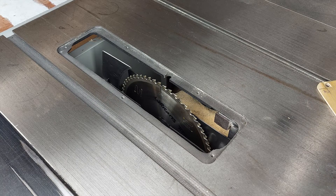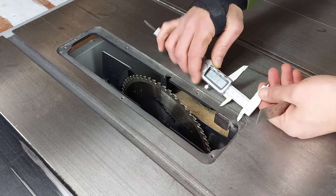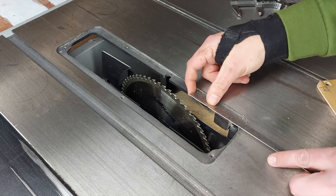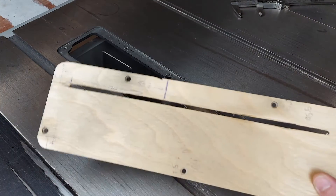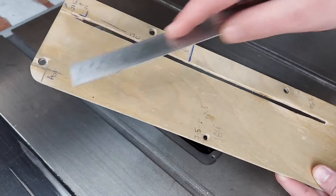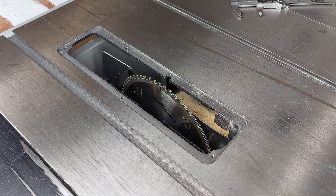So it's that simple - we've taken the calipers, gone from the edge to the center of the hole, and gone from the base here to the center of the hole. Measured it all out, here are all of my measurements, and then we'll go stick that on the CAD and get the laser machine to cut it out.